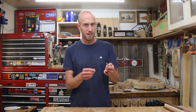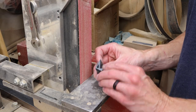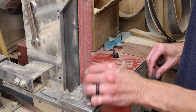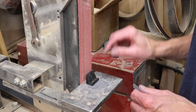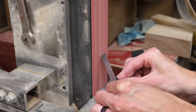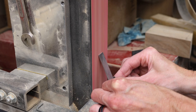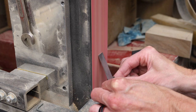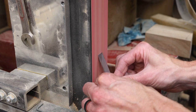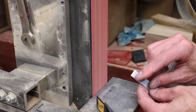I'm not going to worry about heat treating just yet — I'm still figuring out that process. For now I'm just going to put an initial bevel on these blades. I've made some simple angled guides: one is 25 degrees, and another is 30 degrees. These hold the blade and allow me to sharpen it on the belt grinder. I'm doing the 30-degree bevel for now — it's just an initial bevel. The main reason I'm beveling it now is to remove the bulk of the material before heat treating, which reduces the chance of ruining the heat treat later.